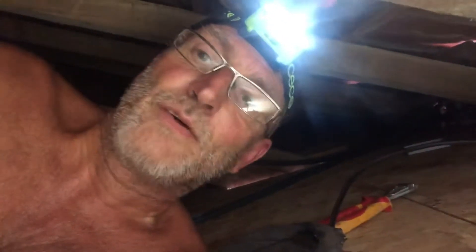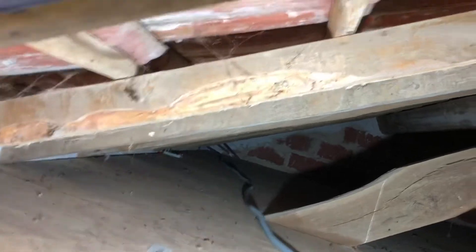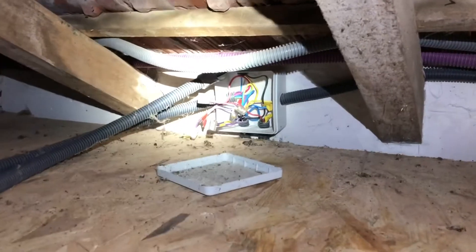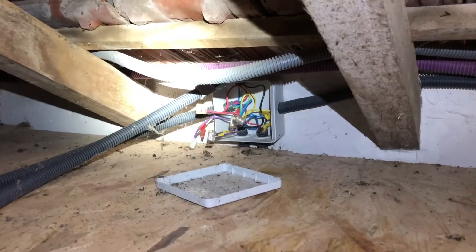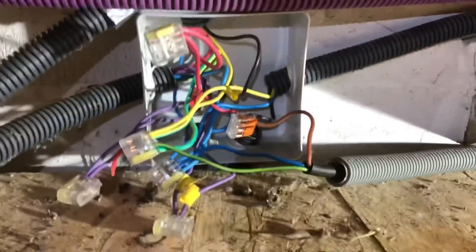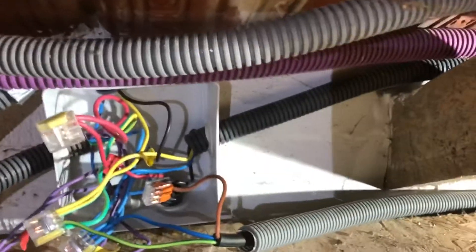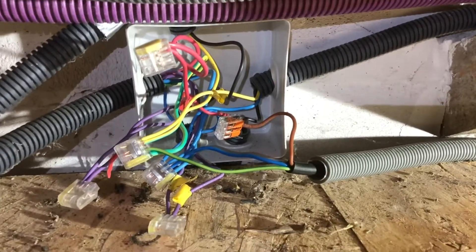I've relocated now — I've moved down from the end of the joist. Right in that far corner is where the cable comes in; we've put some conduit around it. Now I'm going to connect it to this junction box here. This is the one that controls the lights in the living room. The left-hand conduit going downstairs controls the living room lights, and the right-hand one controls the outside lights. The gray cable at the bottom is the new outside light cable coming in from the terrace, and I've connected the live up. That's it — all connected.